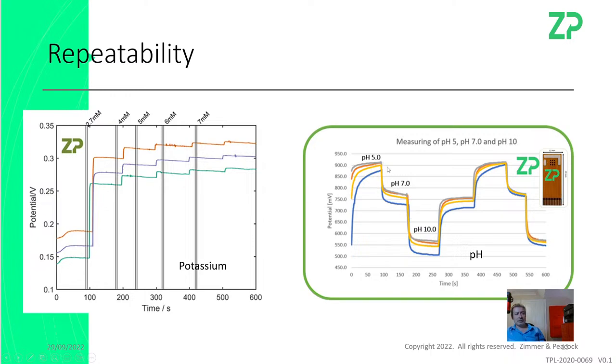These step sizes are from 3 different sensors. These are something like 4 different sensors. Obviously different analytes, similar manufacturing, but it does tell you something: the sensitivity is actually quite conserved. It's actually the offsets that are the variable.